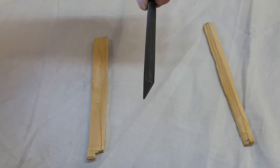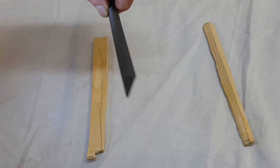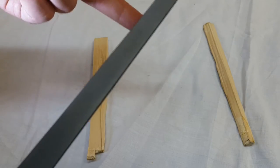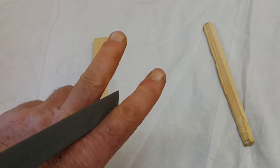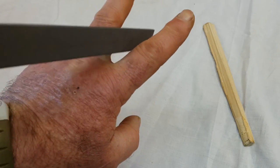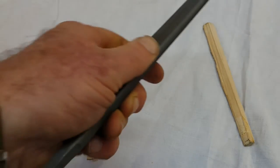The back of the file is half round, and it is toothed. So when you come to file inside some gullets that are half round, your action is to reverse the file like this, and you can deepen your gullets with the back of this file.